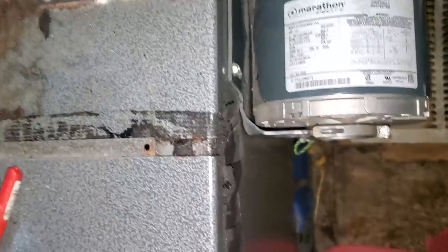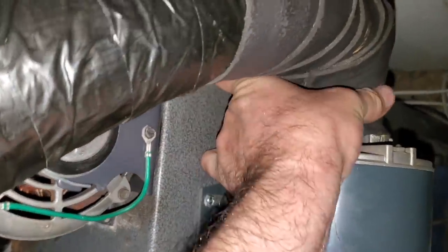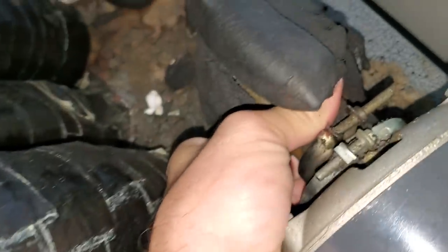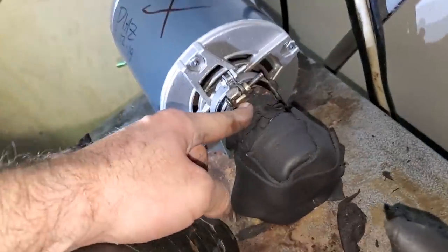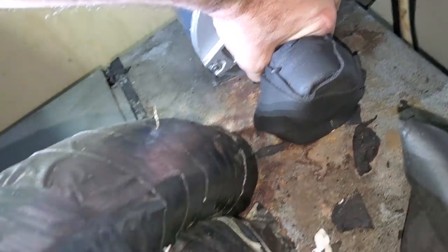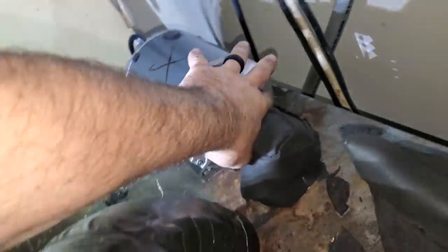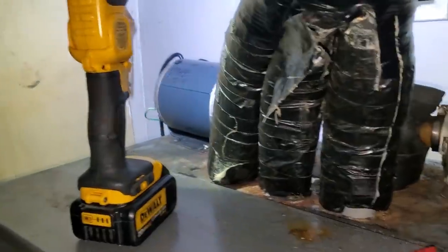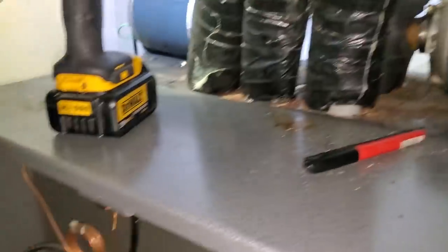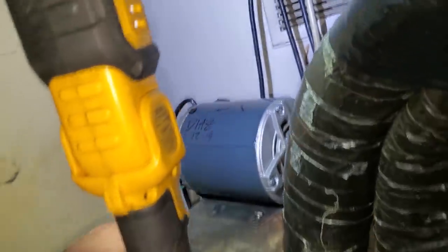These things are always difficult for me to figure out which pump it is, but the best way I can tell is by feeling the pump housing. This pump housing is cold and this other one is hot. So this hot pump is not moving fluid.